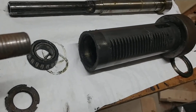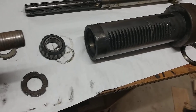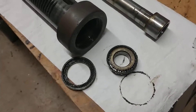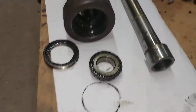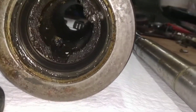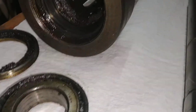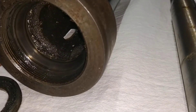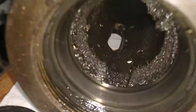I'll check the races and make sure they're not worn — if anything's worn we're going to replace the bearing and the race together, obviously. We don't want to replace just the bearing. Looking at the inside, it looks like there's some metal-on-metal contact at one point or another, and if you look at the race itself it looks like the bearing had been rolling in one spot.